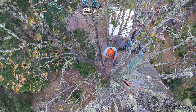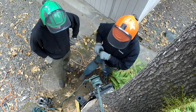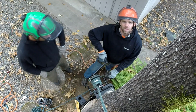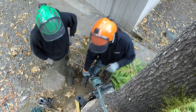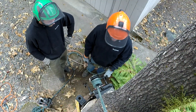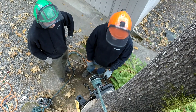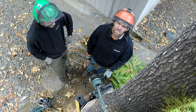So where's the crank? He'll put a few wraps on it, and then he'll go around right here — this little gripper deal. And then he can crank — see, it's tied to that spike there. He can crank this crazy tight. So if there's any new tree service guy and you're thinking about adding something really cool to your arsenal, this is the best thing, in my opinion, that you can add for rigging.